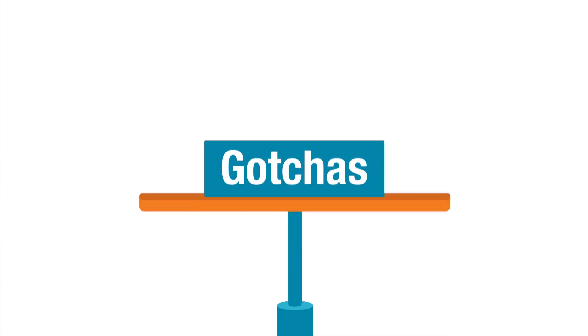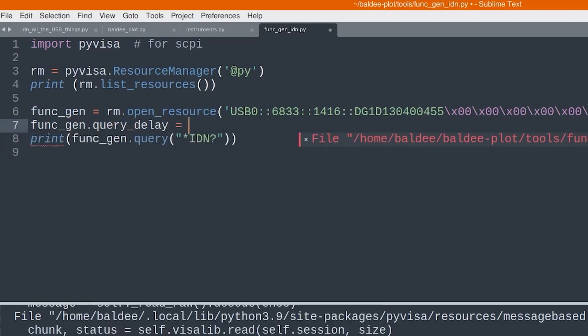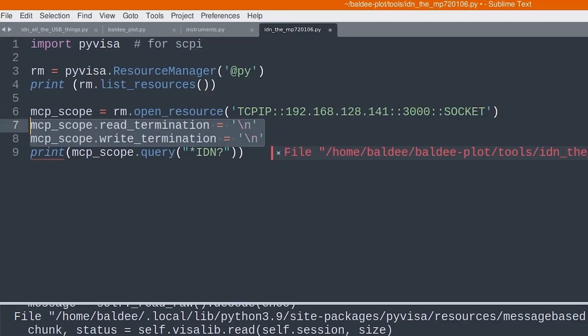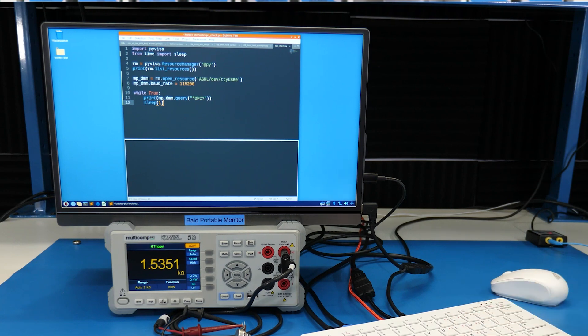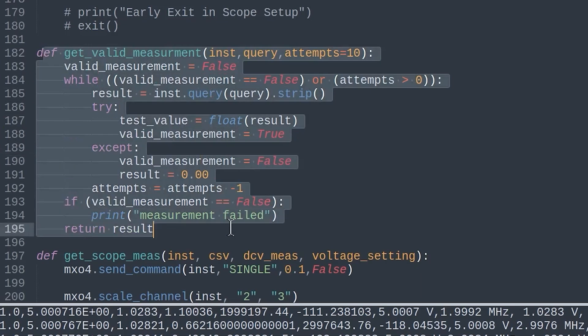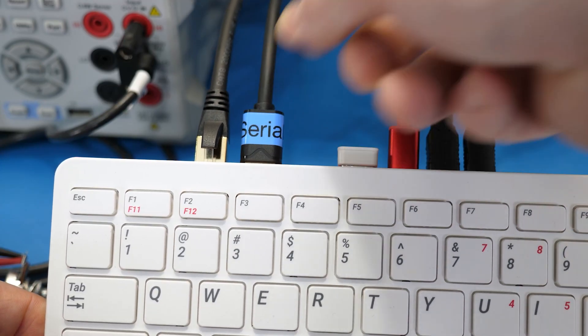One more thing I want to talk about is that this automation stuff is not always plug and play. When your instruments won't talk to you, here's a few things to look for. When the hello world IDN query fails, try two things. First, enable a small query delay to pause between the read and write — some instruments need it, some do not. Next, change the line terminators used by PyVisa. TCP instruments using SOCKET need to be changed to just using the newline character. Not everything supports commands like operation complete, and some instruments — like the DMM — say they do in the manual but always return zero, which can complicate error handling when you cannot tell if the instrument is done processing the last command. One way around this is just to keep sending commands until they're successful.